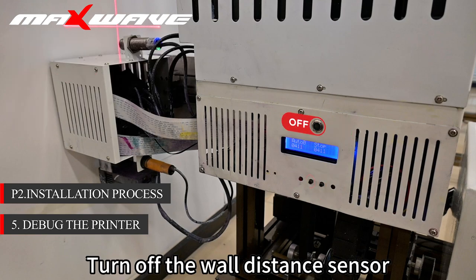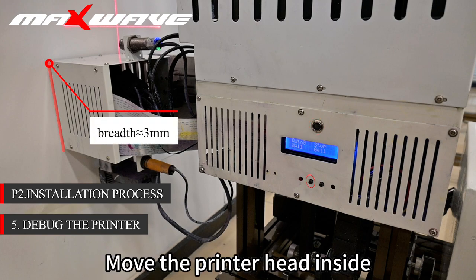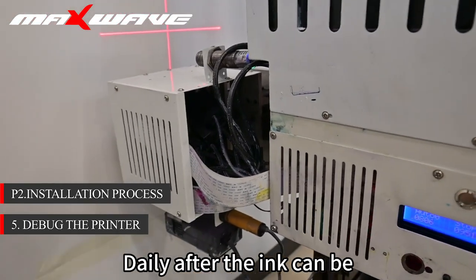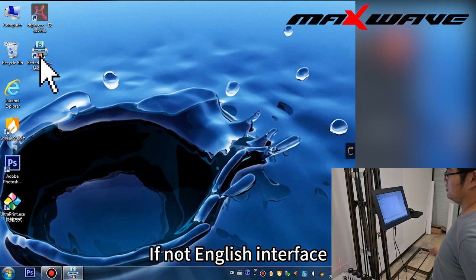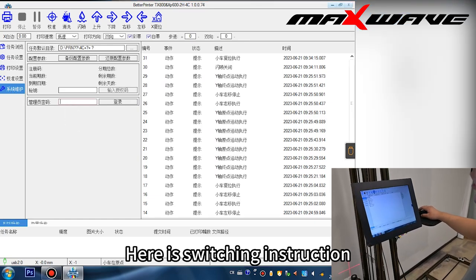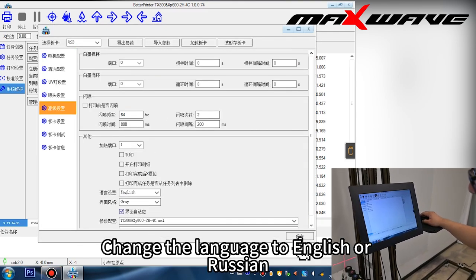After opening, the sensor is on and enabled. Turn off the wall distance sensor switch and press the forward button to move the printer head 3 mm inside on the wall. After daily use, the ink can be absorbed using an ink blotter on the print head. Open PET printer — if not in English interface, here is the switching instruction: administrator password is 666888. Change the language to English or Russian.